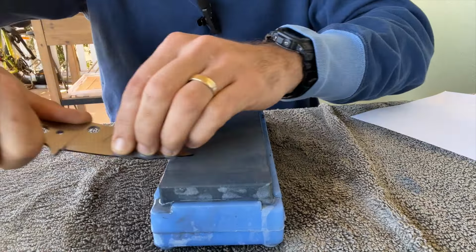This is the 500 Rockstar. This is just honing that scratch pattern, still doing a bit of stock and chip removal, and looking like this. It's tightened all that grit up just a little bit. The 1000 stone, this is like the proper sharpening stone, and this is where I do the bulk of my work, and this will narrow all those scratches down, but still do a little bit of shaping, stock removal, and it looks a little bit like that, starting to get a little bit of polish. You can see the burr there, the silver line.